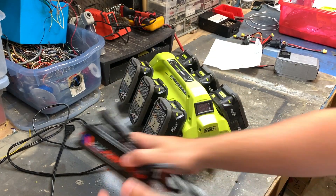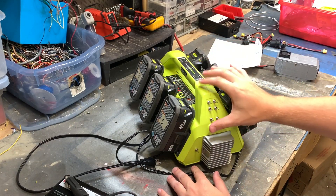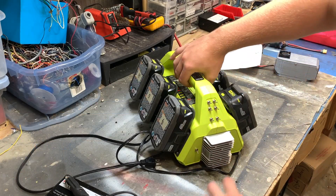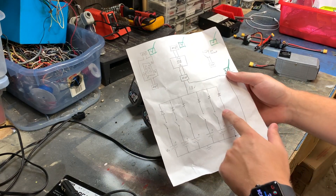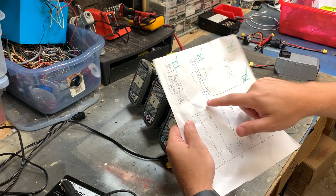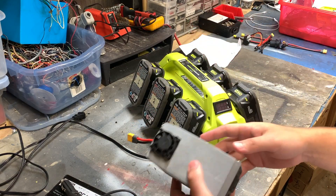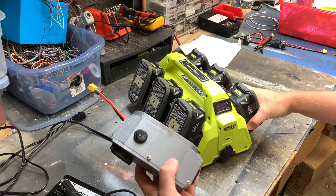This fully has the ability to selectively choose which battery you want to discharge from, or all of them. The buck converter ties into this simple circuit — blocking diodes, individual switches, that was my preference — and all it does is go off the main positive and main ground. Nothing really special. Initially I started testing before I had the buck converter, using my original design where I just shoved a wire in to make it work.